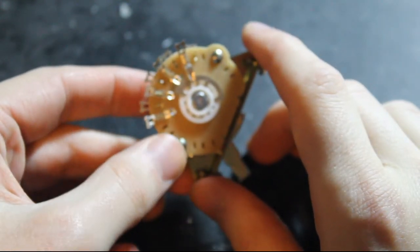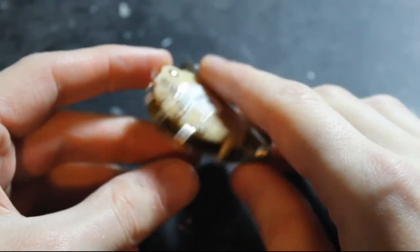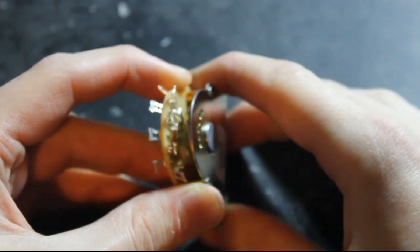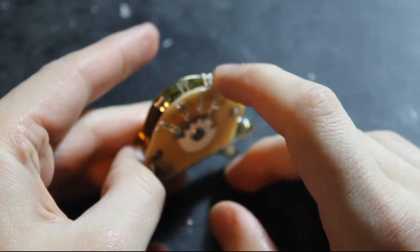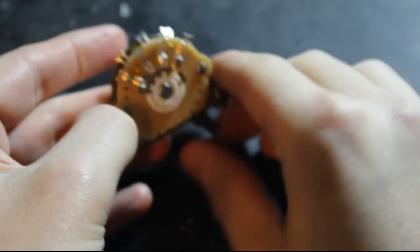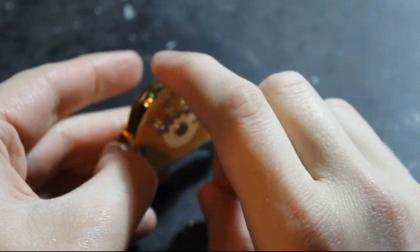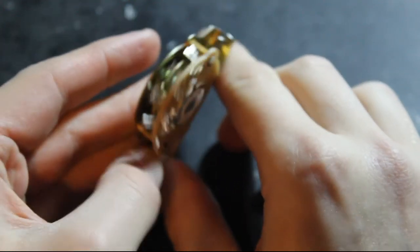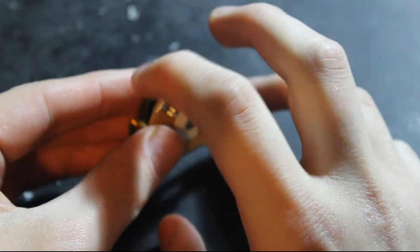If you're familiar with Strats, you'll know that as you switch between the pickups, you also get different tone controls working — that's what the other side of the switch is used for. It switches in exactly the same way. So that's going to be the common on one side, and this side is the common as well. If we want neck, and we know neck goes to one tone, we'll have the neck pickup on that one and neck tone on that one. Middle also has one, so middle tone goes on that one. The other side of the switch flicks between those in the same way, and we connect the two commons together.